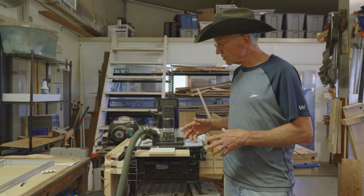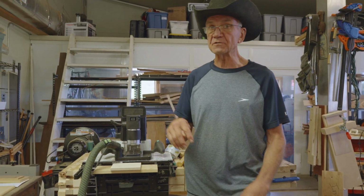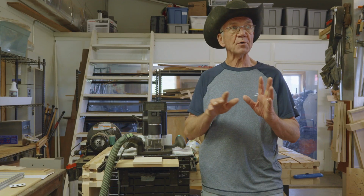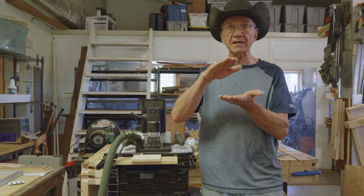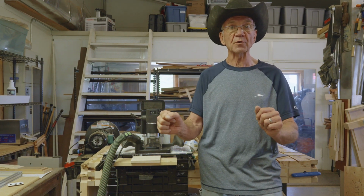And then the other thing I've done on big pieces, right? I'll have a big piece maybe on this workbench. If you've got spaces on it, you can just use maybe some flathead screws and just screw it down, as long as they're not in a spot that you're going to be cutting, and if the flathead screw is at or below the surface so it doesn't interfere with the Shaper Origin moving around, that can be a great solution for bigger pieces.